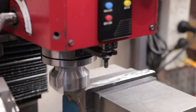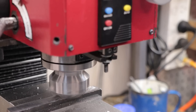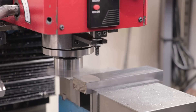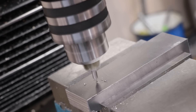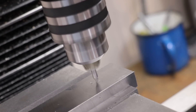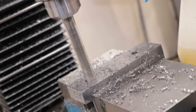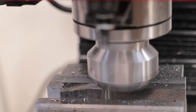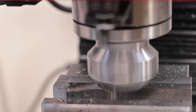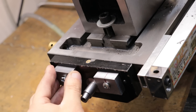I'll start off by cleaning up an off-cut of steel with the face mill. I'll then drill two holes: one of them for the insert to stick through, and another one for a stud that we can mount a set of gears on. Now the aim will be to mount this on the front of the bracket, so what I'll do is I'll make up some tabs. The tabs are screwed in place, and I can then weld the part up in situ.